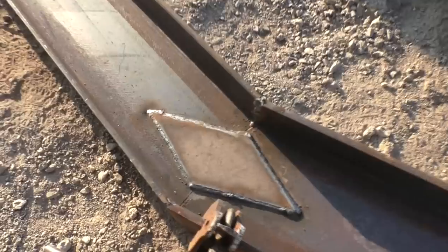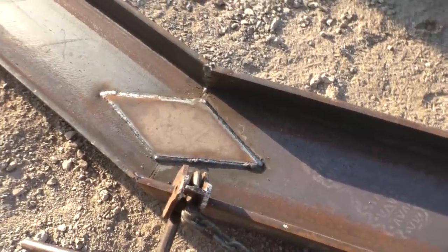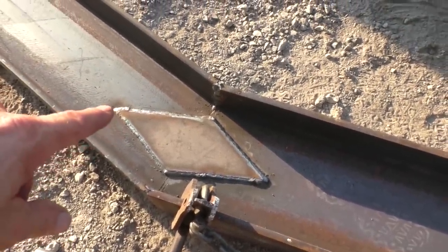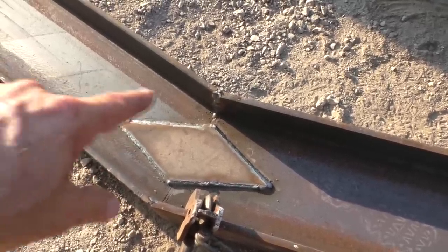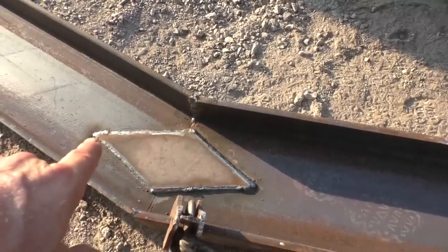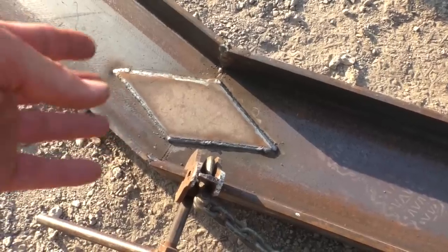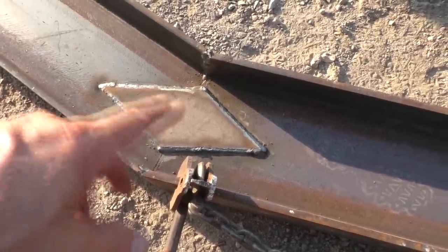Now, as to the artistic fish plates, the diamond and the rounded corners, those plates are designed so that they relieve the stress. There's not one hard stress buildup point like you get with a square corner. These have less stress buildup in these corners, so less cracking due to fatigue. In all honesty, that's not going to fatigue crack because I only got like maybe 30 miles over road to get to the port, so it's not going to have time to do that. But if it was a frame underneath your truck or a tractor or something that's going to spend a lot of time going down the road, you might think about it.